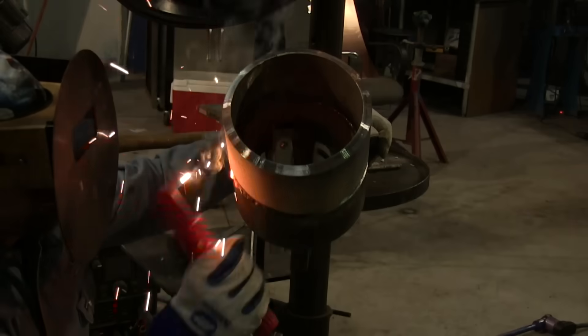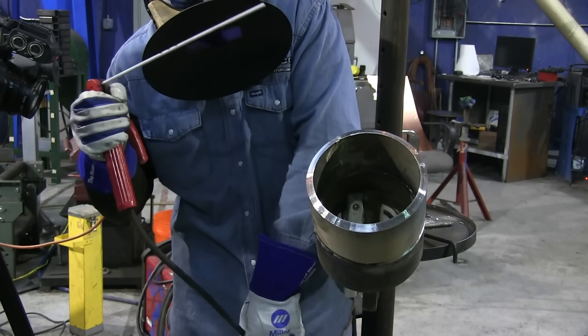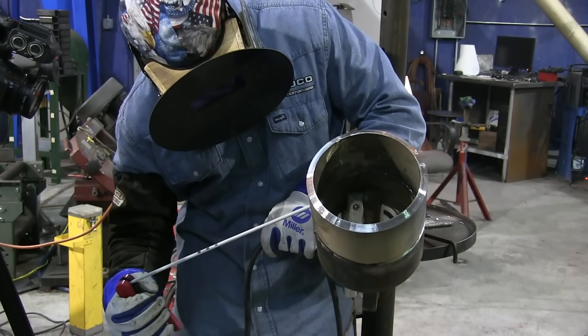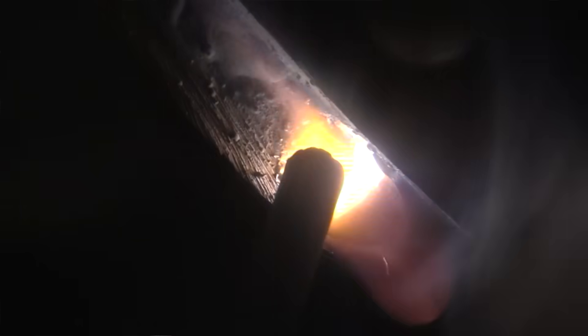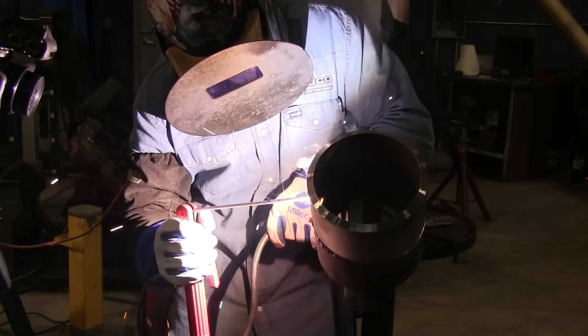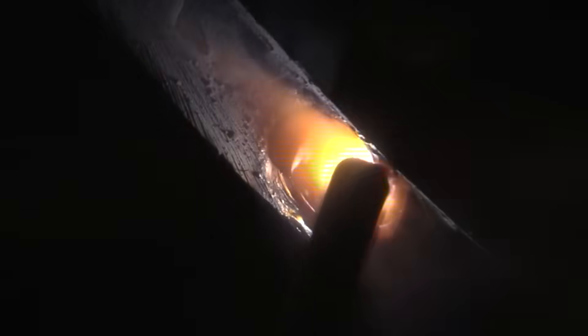Because this weld has been ground down, it requires quite a bit of fill. Andrew is making circular motions and backing into the puddle to fill it flat. Probably would have helped if he hadn't ground down as much, but he's doing a great job. On a restart, he strikes off ahead, comes back into that bead, welding over top of all the arc marks. Using one hand and propping — steadying with the other hand. I always found it's best to use a little circular motion or some type of small oscillation, because you're going to shake a little bit anyway.